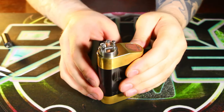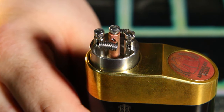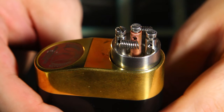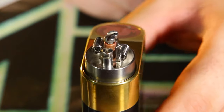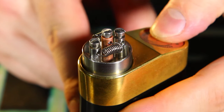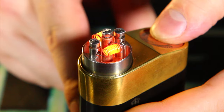There we have it — our 10 wrap spaced coil. It looks pretty good. There are a few little spacing issues here and there, but once we get some heat on those coils it'll make them a little more rigid. So let's go ahead and heat these things up and see where we're at. Pulse firing at first, just to get a glow on those coils.